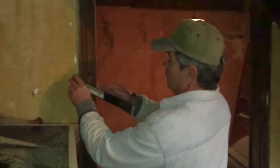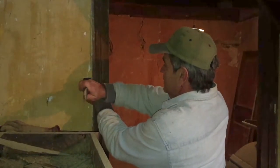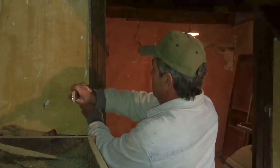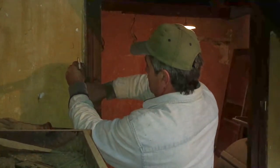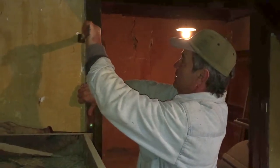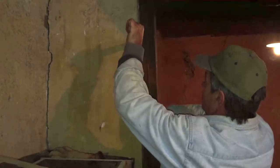These are gonna be my two primary tools to get the trim off. Nice flat bar, good claw hammer. Now we're gonna want to go really slow because we're gonna try and save this trim because we save everything. You never know when you're gonna need it. I was able to get just a little bit of a lift under here with my hands. And you have to just go nice and slow because this old wood is brittle and it likes to split. But if you go nice and slow, the nails will come free. You don't have to get it all in one pull.